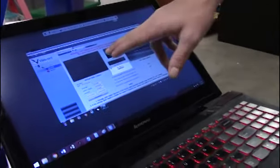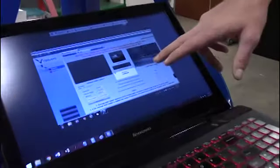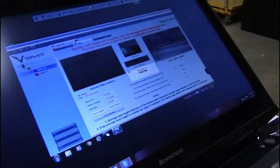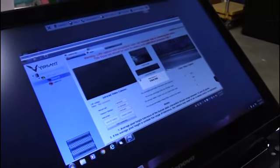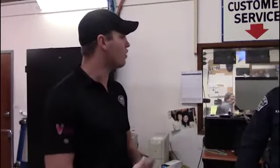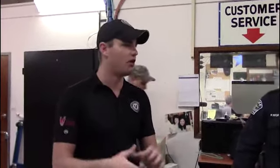You can see the vehicles coming through. You're going to get the overview image of the license plate and the close-up image of that tag. When deploying, I count ten cars — wait for ten cars to come through. If I hit nine out of ten, I normally call that camera good. If you're trying to get ten out of ten every time, you're going to spend all day tweaking that camera and it's probably not going to get a lot better.